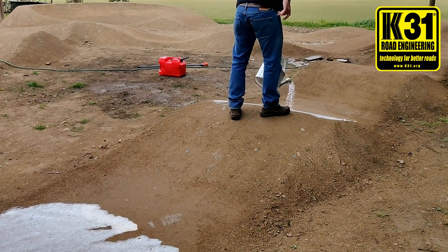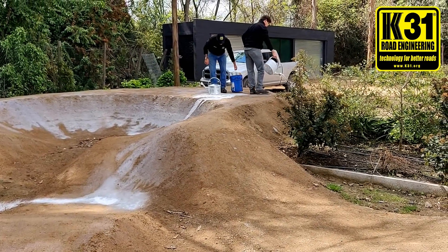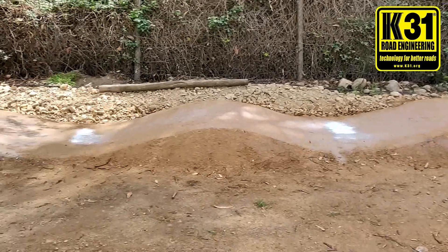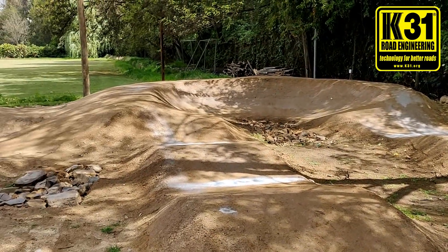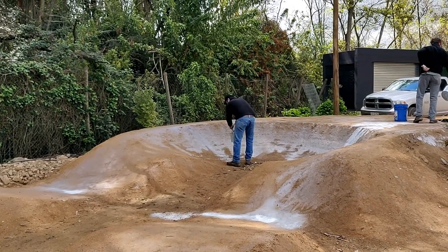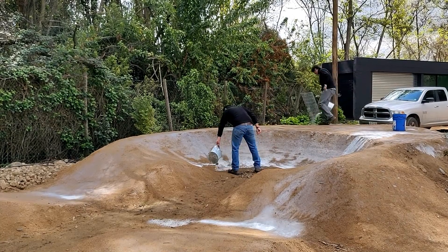The same way we do soil stabilization — we normally do three seal coats — in this case you're okay doing two coats. The reason for two coats is that you don't want to do it too thick, because then it'll take long to dry and it'll be sticky for a while. Remember, our product is 60 to 65 percent solid, so you want to dilute it with water to make sure it goes into the soil, giving you extra protection.